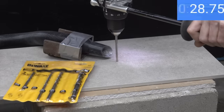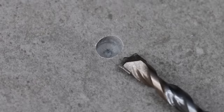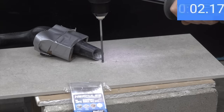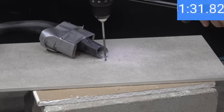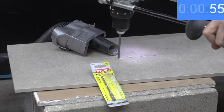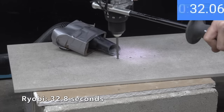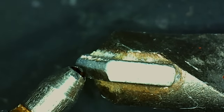The DeWalt really struggled on the second and third tests and the new quarter-inch bit struggled here too. After three minutes, the DeWalt only made a quarter inch of progress into the tile, with the tip heavily dulled. Testing the Hercules: while it didn't match the Irwin's 23-second time, it was still able to drill through the tile in a minute and 32 seconds, though the bit experienced quite a bit of wear. The Ryobi successfully completed the first three tests and also did very well here, drilling through the tile with a 32.8 second finish to move into second place behind the Irwin. The Ryobi also experienced less wear than some other brands.